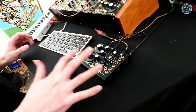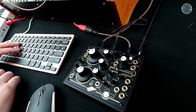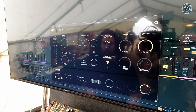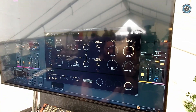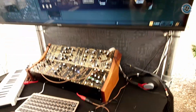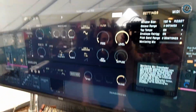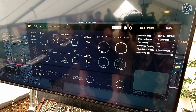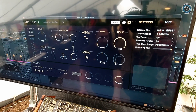This has been a two-fold development — I did the hardware analog circuitry, and it's expanded with a control interface in the virtual domain. It's currently connected over USB-C to a laptop, and this is the C Shell's VST plugin interface running inside Ableton. The C Shell itself is class-compliant audio and MIDI, functioning as a sound card — audio coming into a track and bussing back out over the main output. The plugin lets you define your direct monitoring mix. It's stereo in, stereo out.